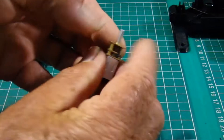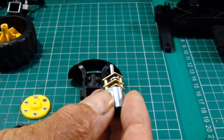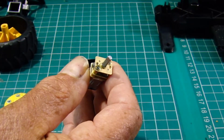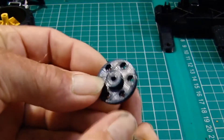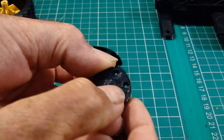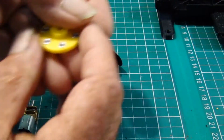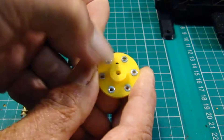We're going to be using N20 motors and the output shaft speed is 60 RPM. It's got a D-shape on the end of the shaft, so in order to attach some sort of fixing I've come up with this hub assembly. It's off the printer and it's got a D-shaped three millimeter hole in the center, six millimeters deep. I'll cross over to the yellow one so we can see the highlights of the holes — it's got a three millimeter center hole, D-shaped.